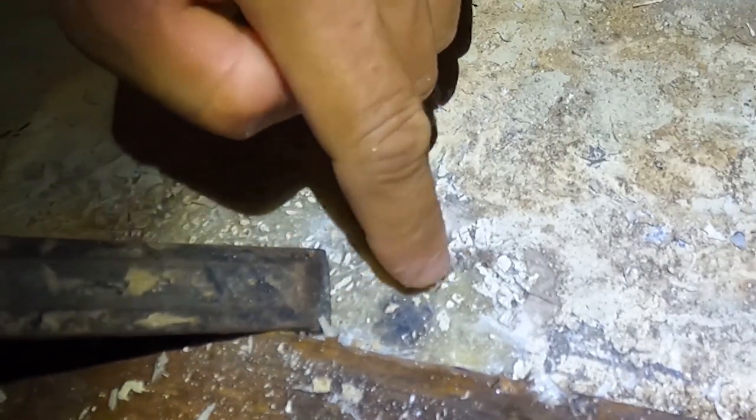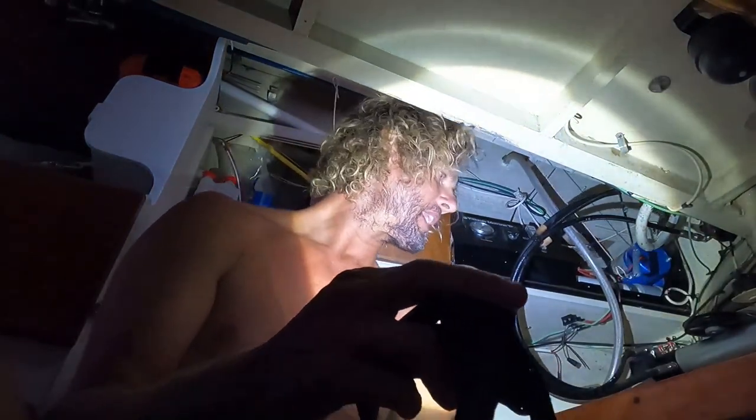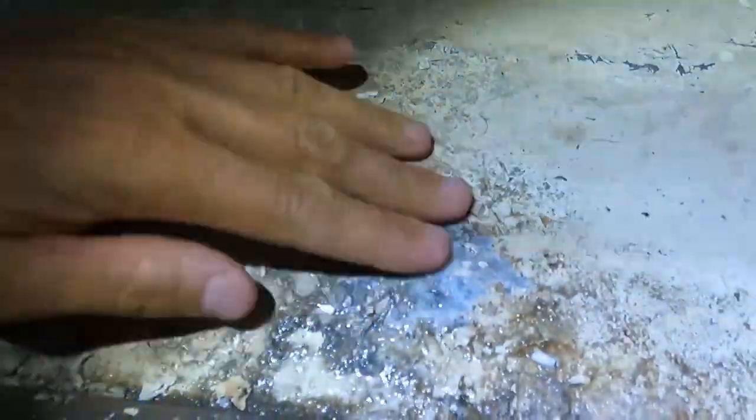I have another epoxy job to do today, so I'll recover this later. This spot here is one of the holes I buried the epoxy filler in, so we need to dig it a bit to get rid of the plug to see what's there. Yeah, it's definitely salty and it smelt like rotten eggs — typical stale seawater smell. It was really just leaking at that spot, but looking over there, that's all wet and moist. The wood here shows indication of constant wetting. It looks like the weeping starts about here. More salt water, and here at the very back of the boat there is a pool of water where there never ever was a pool — it seems to be leaking from here, and there are more weeping spots and little pools.